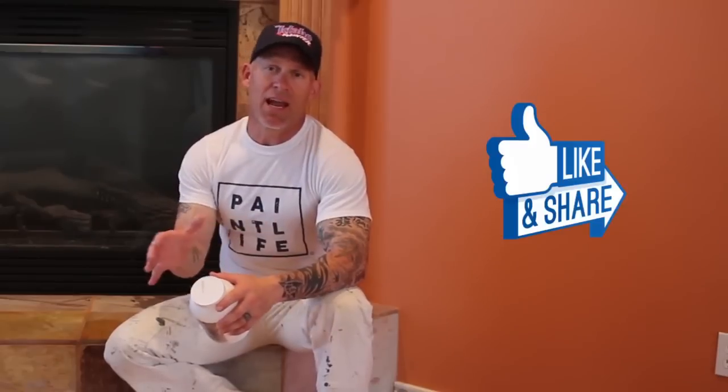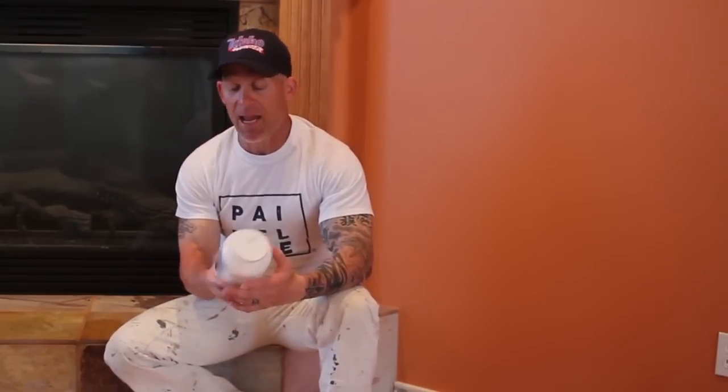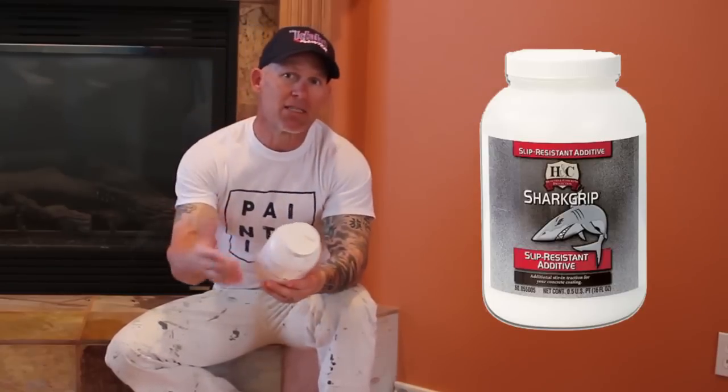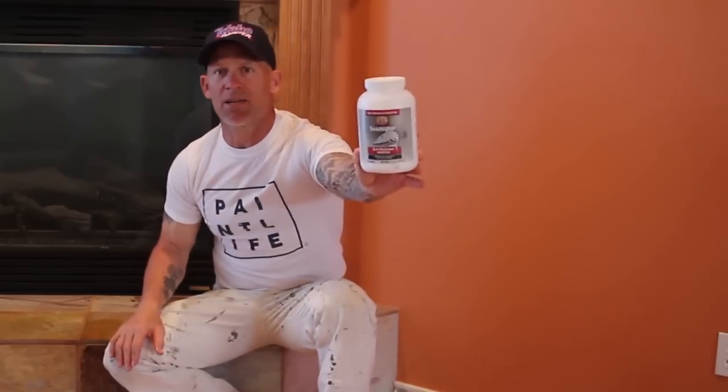This is going to apply to epoxy floors and stain. We use H&C stains to actually stain concrete floors too, which is a lot less expensive than epoxies, but it's not as durable and it's not as resistant to chemicals. To make your epoxy floor or stained floor a non-slick, non-slippery surface, I actually have this product right here. It's from H&C, hopefully you can read that from here, and it's called Shark Grip. It's a slip resistant additive.